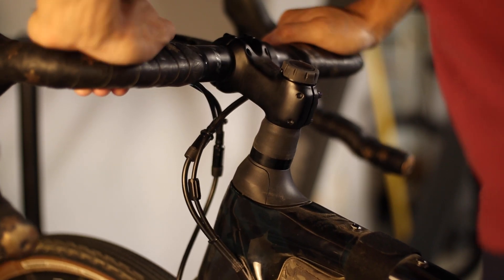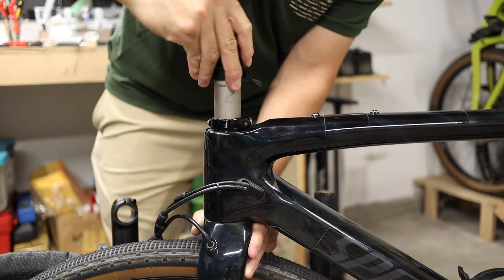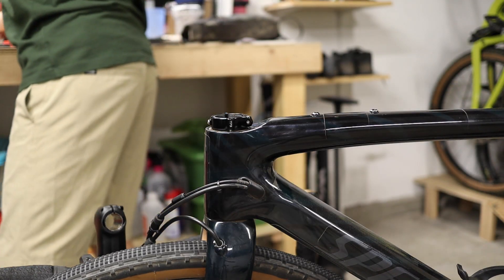It's a great system and it definitely helps to smooth out the ride, but many complain that it's perhaps too proprietary and it can get expensive to replace, especially since the company claims you're supposed to replace it after every 500 hours of use, which is like once per year or even more depending on how much you ride. At the moment there's no way to completely do away with the Future Shock since the fork and headset design are completely different from a standard fork and headset, so owners of Future Shock equipped bikes are basically stuck with the technology as long as they own the bike.